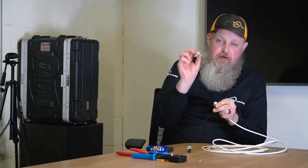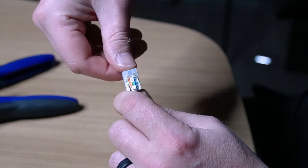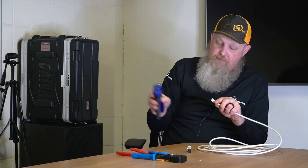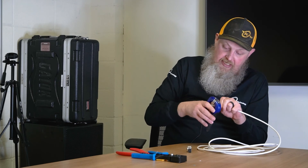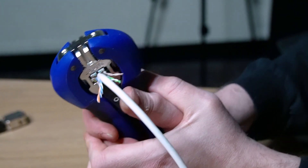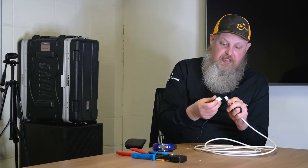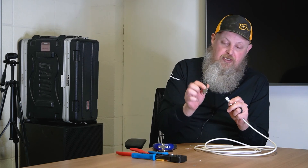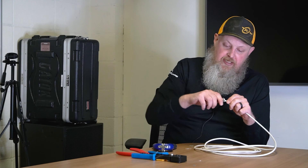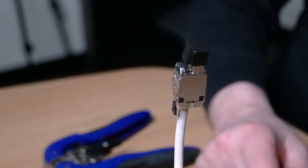Then you take and put them in the little slots that are available for those colors, give it about a quarter turn, and pull down. All we are looking for is to make sure the white wire of the pair is on the outside edge of the housing. Next, you take the RevConnect top, slide it on top, push down, flip the little switch on your RevConnect crimping tool, push it in, and squeeze. That will crimp everything together so you can slide it into the connector. We are using a male connector right now — push it into the connector until you hear a click, close it up, and you got your RevConnect connector.